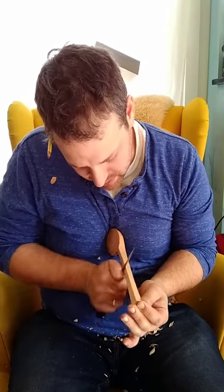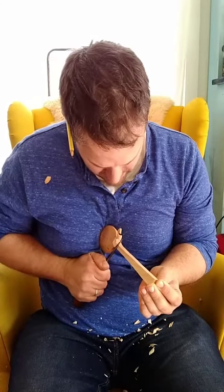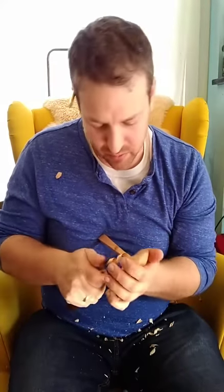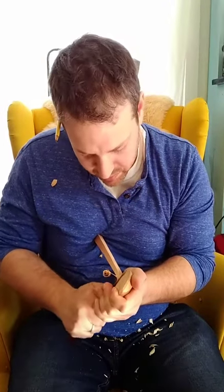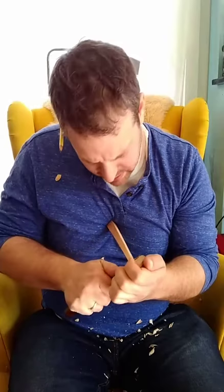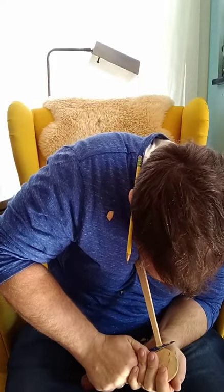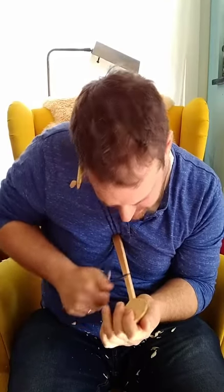For these long scoops I like to keep the handle as simple as I can. Whether or not I do a bump down has to do with the geometry of where the mass of the head is — the bump down isn't essential, it's just a nice trick to have up your sleeve if it helps you get a nice crank in the spoon. But sometimes you don't need it, as is the case with this one. Interestingly, the way the grain is, it's coming up the handle.